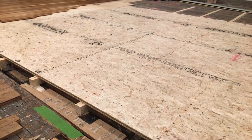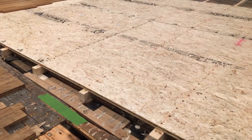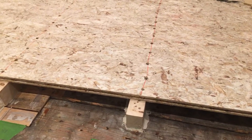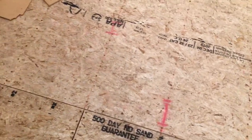I'm posting this video so someone else out there doing this can benefit. A couple things to point out: I didn't run my OSB plywood all the way to the edge — I left an area to overlap because you have to have something to screw into. Also, if you're doing OSB plywood, you definitely want to leave an eighth-inch gap all around it. You do not want to put this stuff right up next to each other, particularly anywhere that might get moisture. This stuff has an expansion joint built into the lip, but on the ends you have to leave an expansion joint as well.